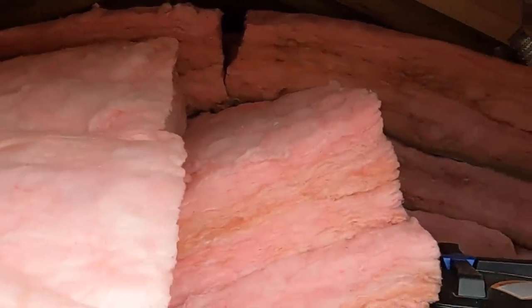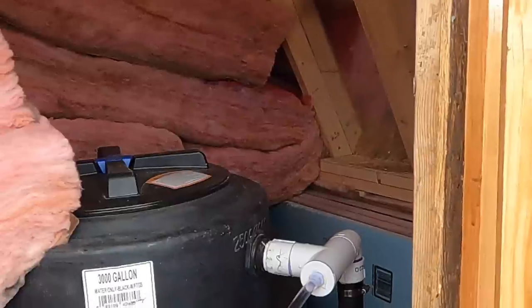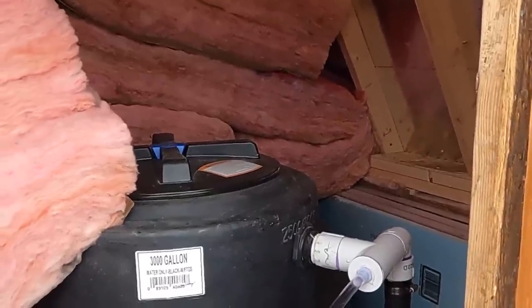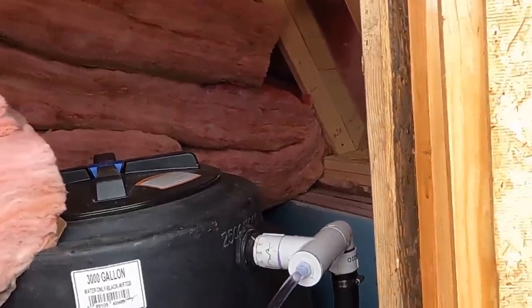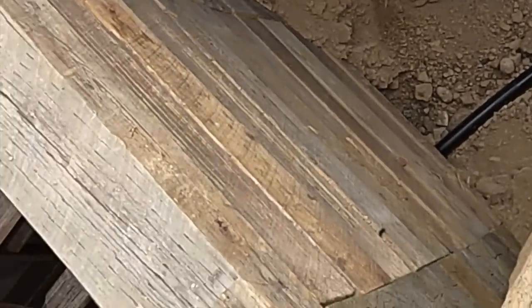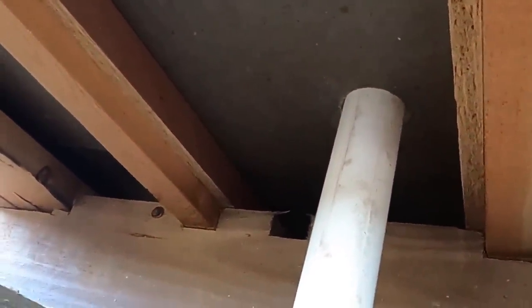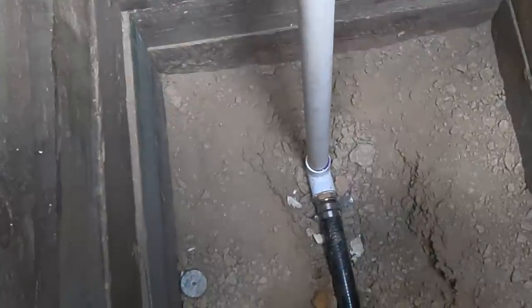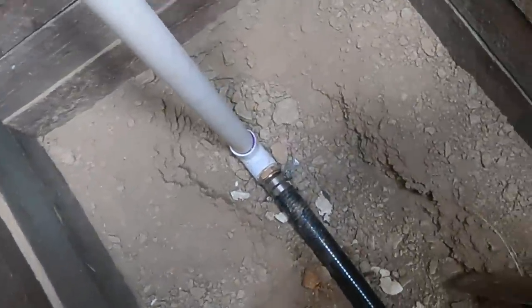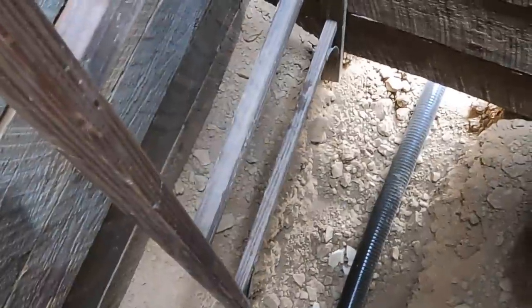So before I go ahead and fill out the rest of this, I want to actually go get a load of water, put it in here, and test all my joints before I start backfilling this. So this is where I have my 1.5-inch going underneath the wall of my pit. So you can see this is where it comes down through the floor. I have 1-inch subfloor, and I have 2 inches of insulation. And you can see where I go down and I hook into my PVC. That's what runs out the back underneath the wall.